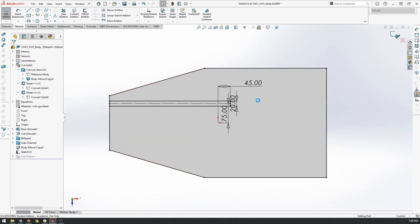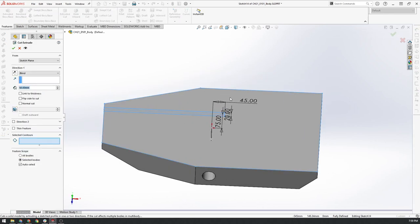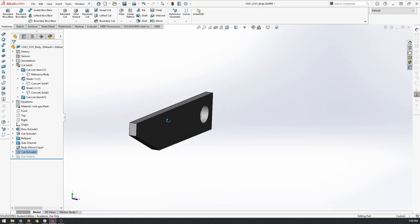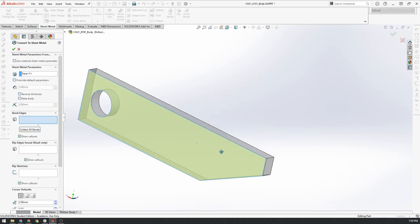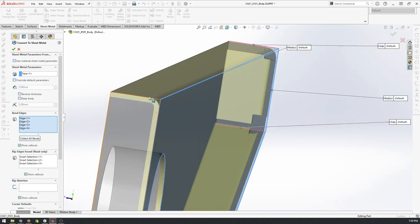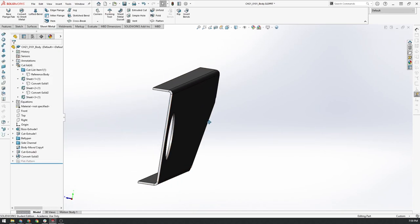That's a great point to bring up — our initial sketch used the origin as the central crossbar location, which is super handy now because whenever we have a part we want to reference to the crossbar location, we can just dimension it directly from the origin. So let's exit this sketch, go to Extruded Cut, cut away everything we don't need using Through All, and we've got this neat little shape. For this next one, we'll again go to Sheet Metal, Convert to Sheet Metal. We'll start with this side as our base flange and fold it around like we did with the other parts.